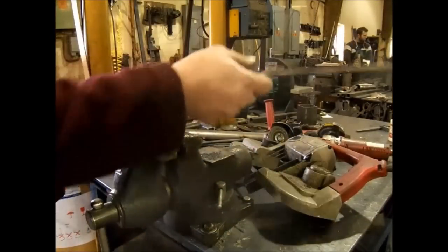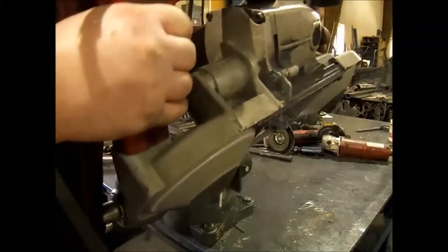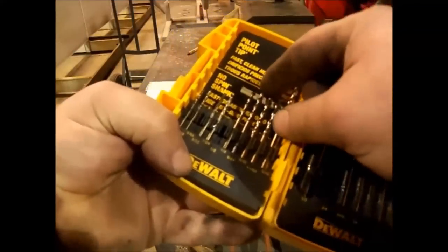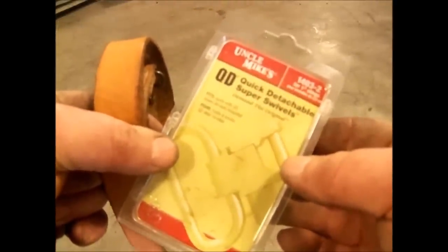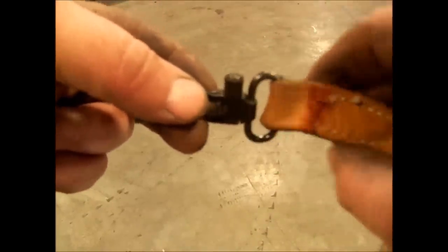We'll drill with a five-sixteenths diameter bit for our swivel attachments for our sling. This is five-sixteenths cold steel rod — measure out an inch and one-half length piece, and we'll cut two pieces of this. Now that you have your five-sixteenths cold steel rod cut to an inch and a half in length, set it inside the vise so it doesn't roll. Take your punch, one-eighth of an inch from the end. We'll do both of them, then drill the hole using the nine-sixty-fourths. That pin we drilled is for a quick-detachable swivel for a gun sling. The pin attaches just like this, then you lock it. Those holes we drilled into the handle — this will fit inside and we roll that into place, going straight on through.